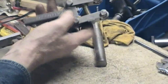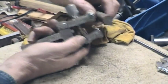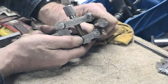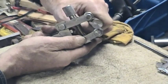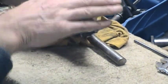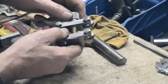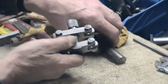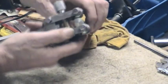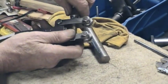Then we come off and we probably add maybe a quarter or half a turn - depends on the material and diameter. That means then that as we advance to the workpiece, we carefully try and pick up both wheels at once. The work's rotating, so it's working on the two wheels. You can see the wheels are opposite, on the diagonal, so when they're both working together you get a proper crosshatch. That means the work is very much less stressing the spindle, because we're nearly over centre - top and bottom centre. And if the cut is not enough whilst it's still cutting, we can increase the tension just a little bit.